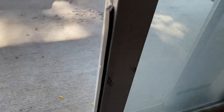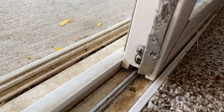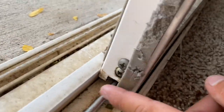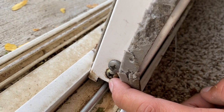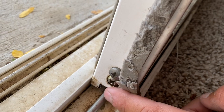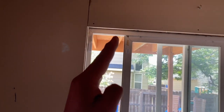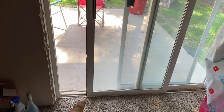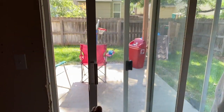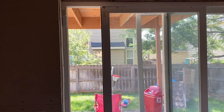What you want to do is go to the front side and loosen that bottom screw just a little bit. That way it loosens and goes down slightly, allowing the door to shift from an angled position to a straight alignment. It's the back screw you tighten first, and if needed, you just loosen the front screw a little bit so the door can go all the way through.